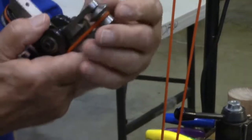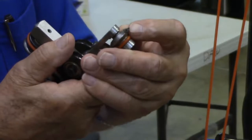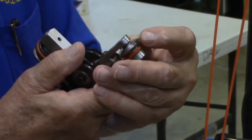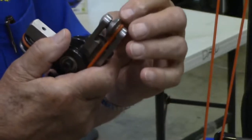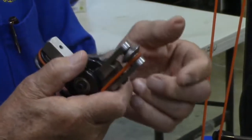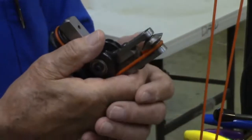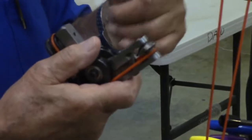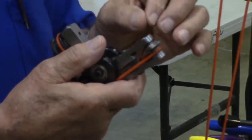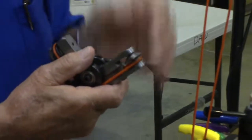It has two little solid carbide cutters. They're little triangular-shaped cutters with a sharp point on all three edges, so if one gets dull, you take that little bitty screw out and hope you don't lose it, and you just rotate it to the next cutting edge, and you're back in business. There are two of them, cutting exactly at the same level. There is another cutter that I have. It has just a solid carbide rod, and you can cut it into different profiles. But they're carbide, so it takes diamond to shape them.